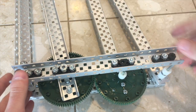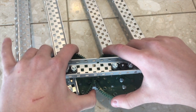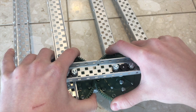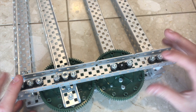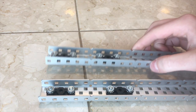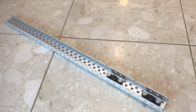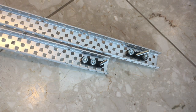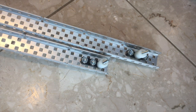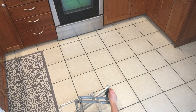This can be difficult, especially because you have to try your best to make sure the bars connected to the gears are parallel when they mesh, otherwise the lift will not collapse as desired. After connecting both bars in the middle, we must connect the ends of the bars together. After measuring the spacing on the middle bar, we move that spacing over to the final bars. This long piece of C channel represents where it would be mounted to the robot, and this shorter piece represents where the instrument would be mounted. I'm using screw joints here, but you may wish to use axles instead. And there you have it — a few rubber bands later and it extends.